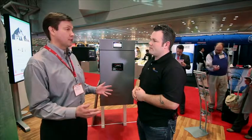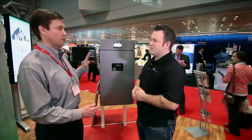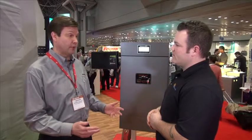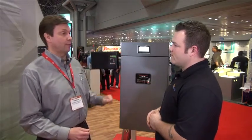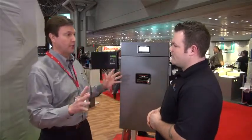For example, if I have a master bedroom that only needs 40,000 BTUs, I can program that zone to max fire at 40,000 BTUs and that's what the boiler modulates to — great energy savings and great comfort. The zone panel communicates to the control with just an RJ45 plug. Just take the yellow cable, plug them in, and they're communicating and you're all done.